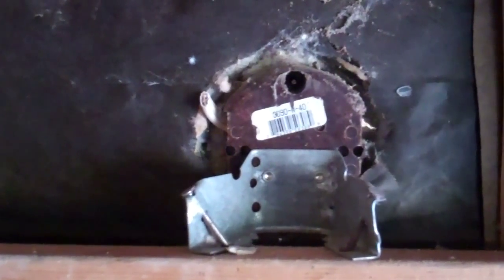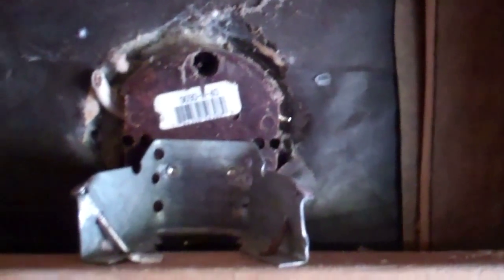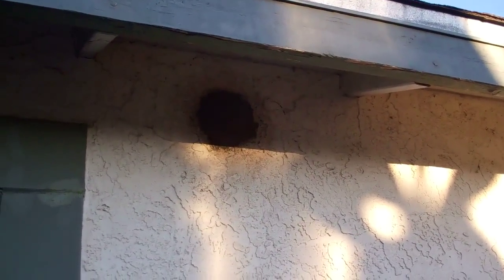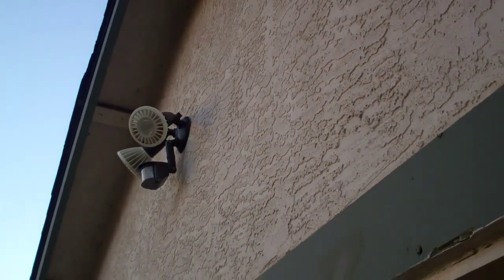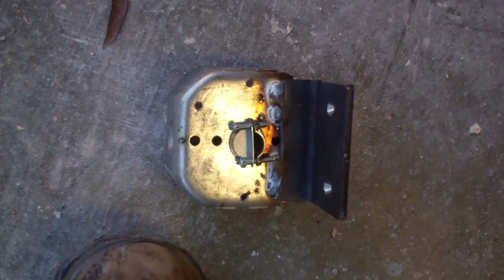There was a light on the outside and I removed that box. I put a 2x6 on the wall with screen on the other side where it was bulging out through the hole, then patched the stucco over it. There's one more Bakelite box I need to replace — it sticks out too far from the stucco where the gasket doesn't seal. This is the box for the flood light on the front of the garage.